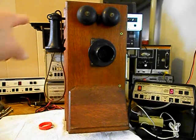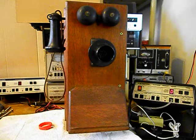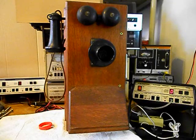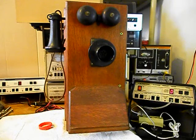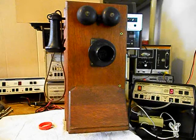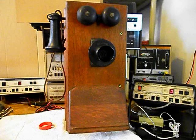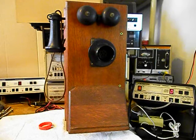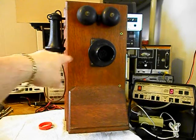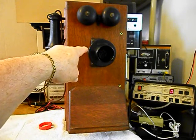The amplified pickup allows you to hear the audio from a receiver. I have an amplifier backed by the video and it has a button on it so I can give dial tone or take dial tone away at any time. The receiver capsule is original — we troubleshot it and it works great, so we're going to utilize it. Lee is going to be able to use an original part of the telephone that's been in his family for a long time. We replaced the receiver capsule cloth cord and we also design and build an electronic amplified transmitter, which has been installed.